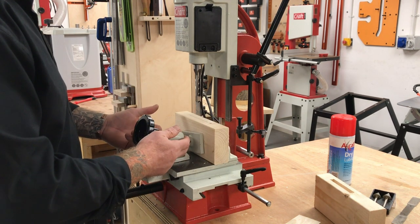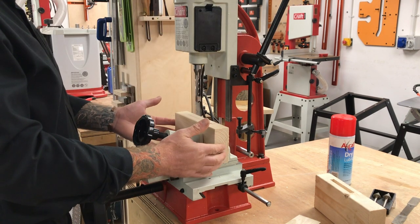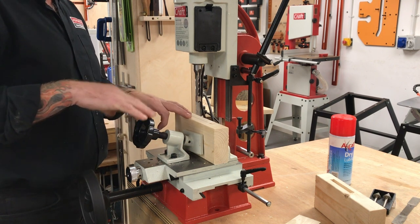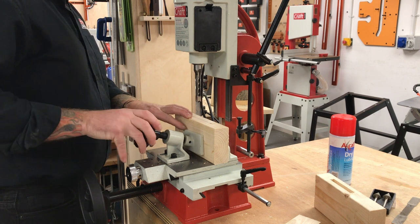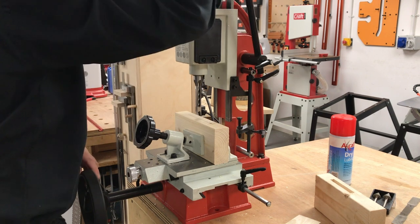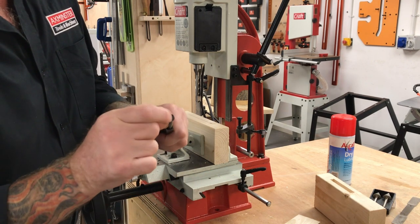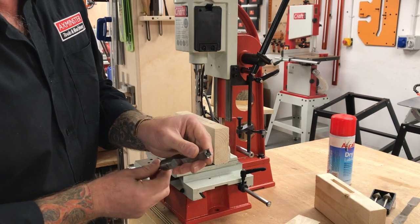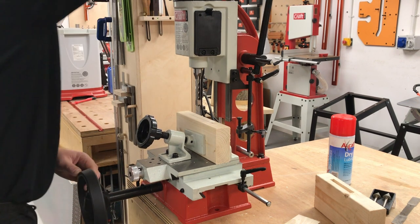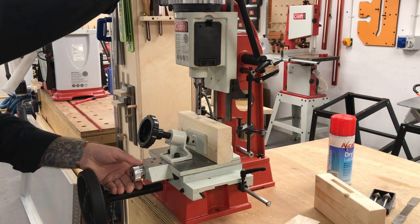You can see the clamping on this machine. There's not a lot of side-to-side movement when you're mortising, but as you come back out of the cut there's a potential for the material to lift up. Some machines have a little foot on top to stop this; a lot use a diagonal clamp that holds your material down into the corner, in toward the fence and down toward the table, just to prevent lift when you're coming back out of the cut. I'm going to centralise first — on these chisels and bits the centre point is dead centre to everything, so that's easy to line up with my centre line.